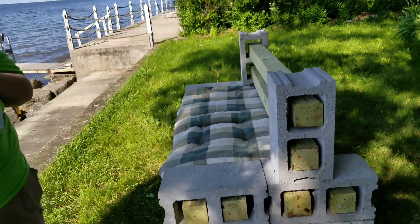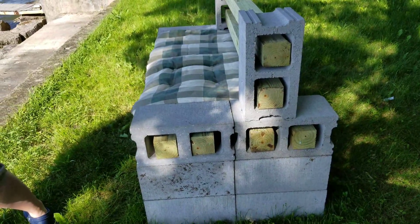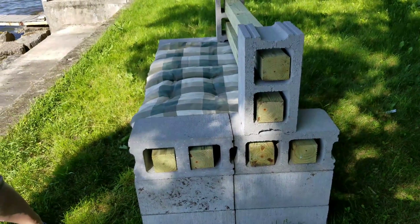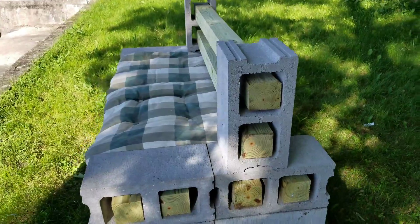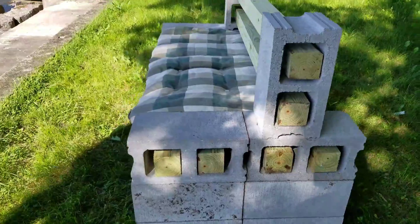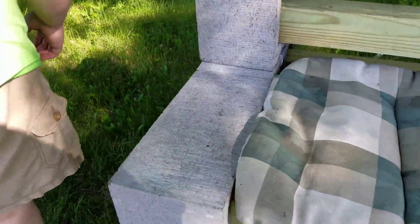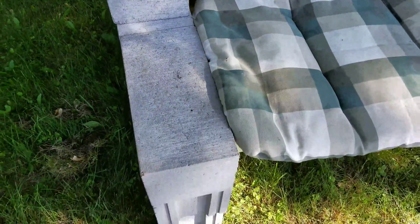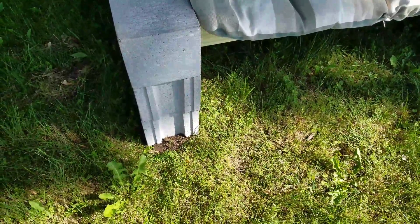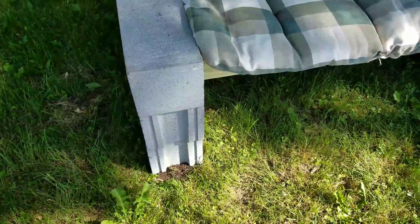This is the bench we made. Basically what you need is four bricks on the bottom on each side with the holes facing up, and then two with the holes facing out. The four-by-fours go through to make your bench seat, and the top one makes the back rest. I got a couple suggestions — some bricks have a flat finish on the front. Look for all the bricks with that finish for your front and top piece, it gives a more finished look. When I get bricks for the next one, I'm going to get all new bricks for a nice polished look.